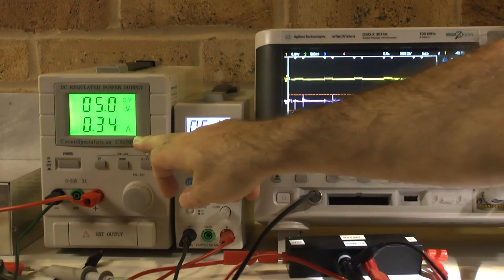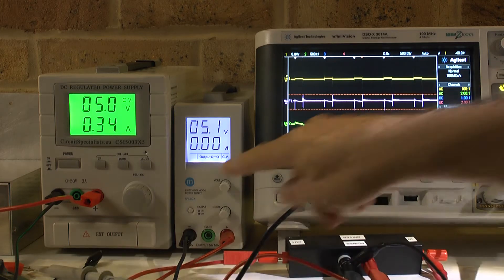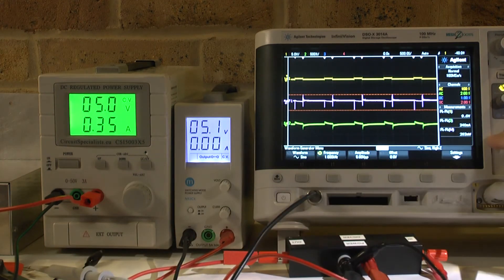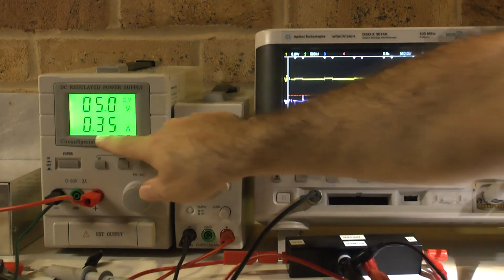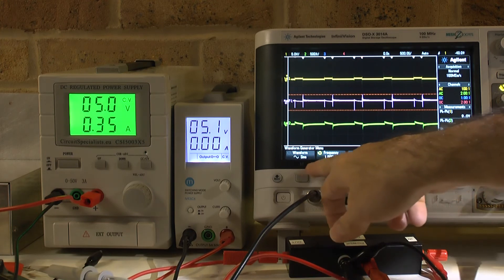At five volts I don't reach my 500 milliamp as expected. The peak-to-peak voltage should be around 10 volts here but I'm not correctly able to measure it because there is no RF coming out — I have to pick it up directly from the network. The current from the amplifier is about 340 to 360 milliamp, and the average power measurement is 280 to 290 milliwatt. We are at sine wave at 1 kilohertz.